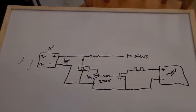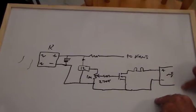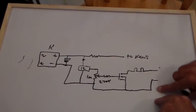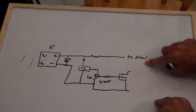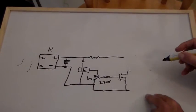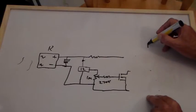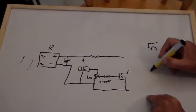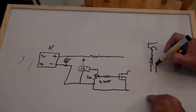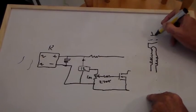How that relates to the amplifier is: in the amplifier, to set the cathode bias — remember in the amplifier I've got the triode — so I've got the cathode. It's actually connected inside the tube to the heater element. And I've got a bifilar RF choke in the cathode. There's my triode.